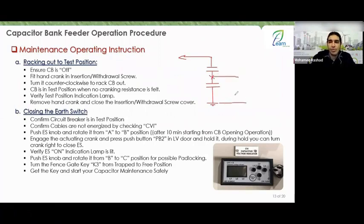It takes this terminal with the ground, connects this terminal here to L1, and there is a similar capacitor connecting to L2 and a capacitor connecting to L3. And where does the last terminal go? It goes to the ground. So now this is essentially a voltage transformer, but it operates through capacitors. Why? For cost-saving purposes. Instead of bringing a voltage transformer with coils and such, it is more economical to use two capacitors. These capacitors divide the voltage between them so that the voltage here is small, just to indicate whether you have voltage present on your cable or not.